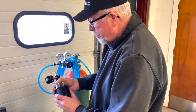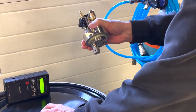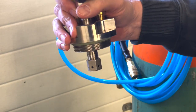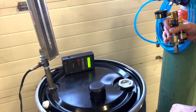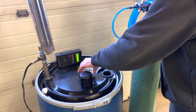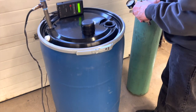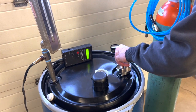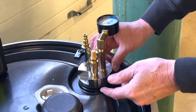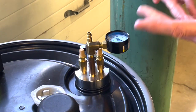The first thing I'm going to do — this has got a protective covering on the threads. We've got a six-sided diffuser that sends nitrogen out in six different directions to help scour all of the air out of the headspace above the fluid. Right now we've got two and a quarter inches of headspace, liquid up to about here. It's 50 gallons in a 55-gallon drum. We install this, being careful not to cross-thread it. It's got an irradiated polyethylene gasket so it doesn't take much to seal it — hand tight is plenty.